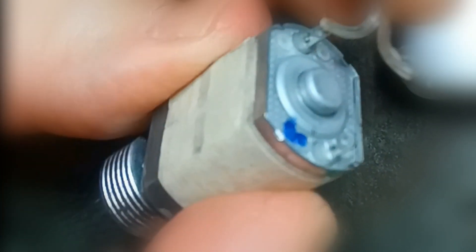After soldering, let me show you what a dry joint looks like. This was a brand new product that didn't work out of the box. I took it out of the box, had a look, and you can see here that the wire has never ever been soldered onto that joint. There's the wire, there's the joint — it was poked through the hole.